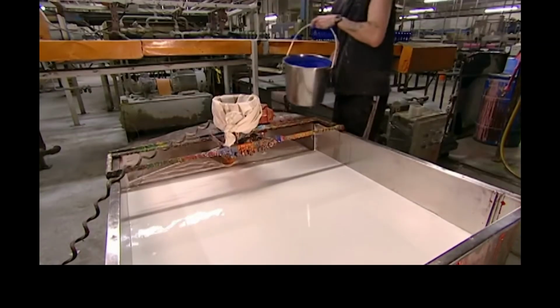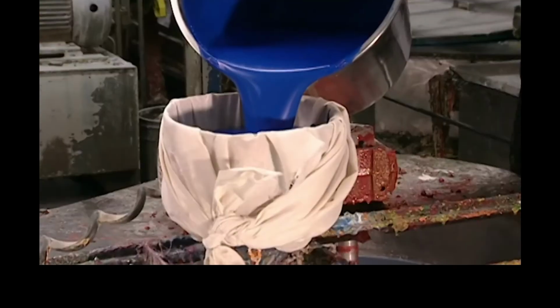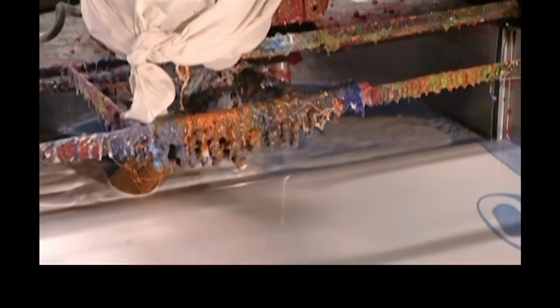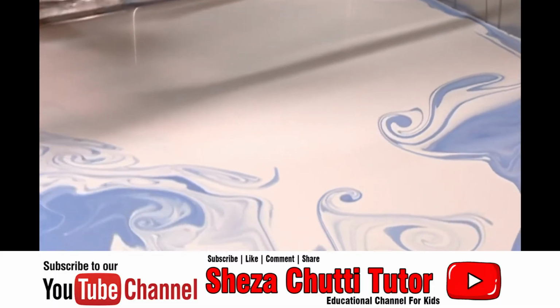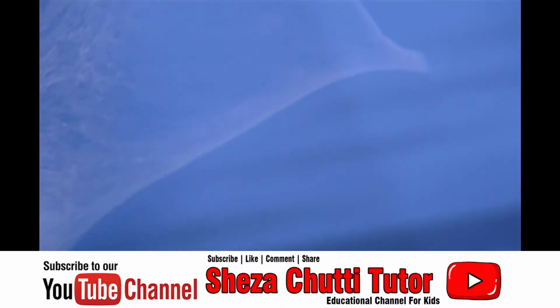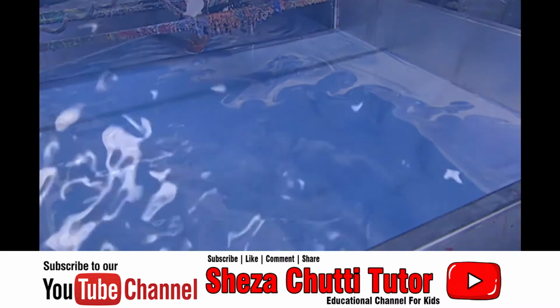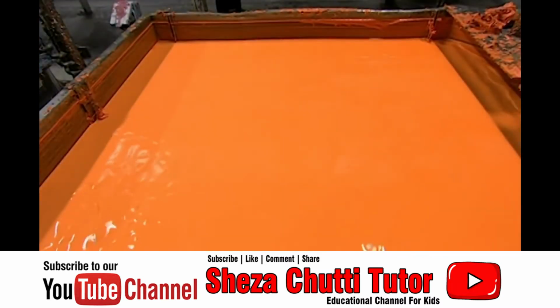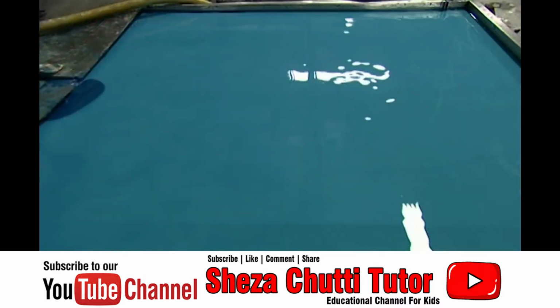To make balloons, dye is poured into a tank of latex. It's filtered through cheesecloth to remove any lumps. Agitators at the bottom of the tank mix it up for 15 hours. This distributes the colour, and it also keeps the latex active so it doesn't congeal. These balloons come in 53 different shades.